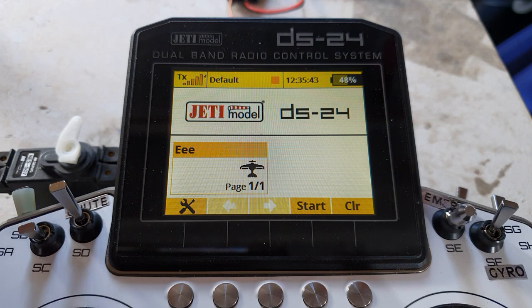Now, I'm going to use this servo here to represent the position of the control. The servo like that, the Jeti is outputting 0%, which is the midpoint. If it's rotated anti-clockwise, it's gone to -100%, and if it's rotated clockwise, it's gone to +100%. Now, I don't have any smoke pumps, but those who do, some tell me that their type of smoke pump counts the off position as being at -100%, and some smoke pumps count the off position as being at 0%. So we're going to look at how to program for both of those conditions.